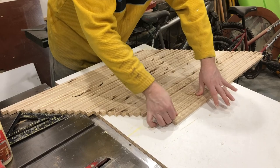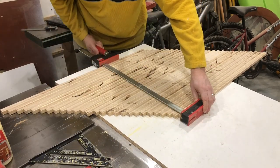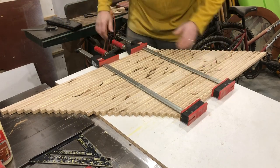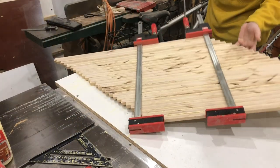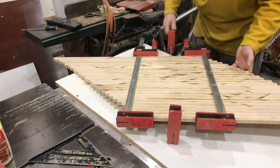You don't want a 90-degree edge. In this case I'm doing 45 — you could do other angles — but in order to get a chevron pattern, I'm gluing it up at roughly a 45-degree angle. It does make glue-up a little bit more tricky and you have to use more clamps, but it gives you a better yield of the material in the end, so it's less waste.